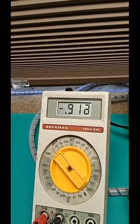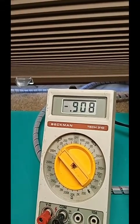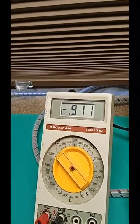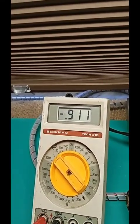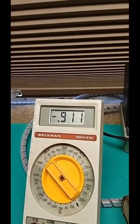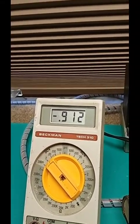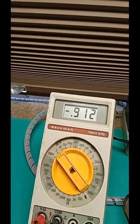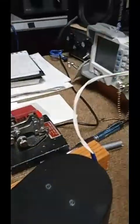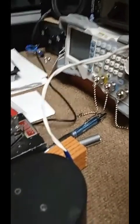to the millivolt. The problem is, as it's adjusted, the voltages will tend to drop. So go past the peak either side back and forth a couple times, and it won't read 910 millivolts, it might read 890, and it'll drop off. Now adjust the top slug, and notice what happens to the sound from the speaker.